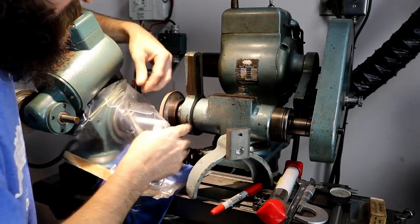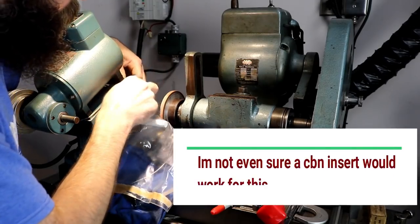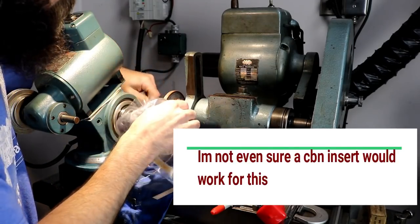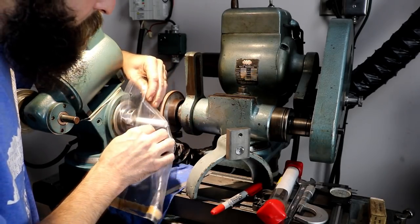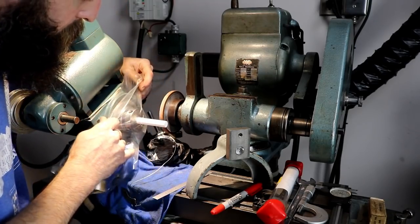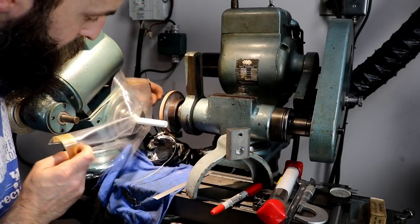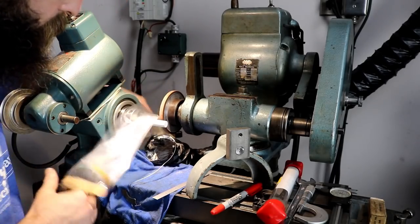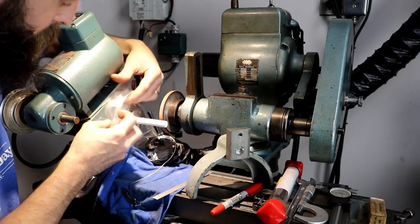And I don't have a collet system for my lathe, although I do have hard turning capabilities, or the tooling for hard turning. So I haven't tried to hard turn this, but I have diamond ground it, and it really works well. So that's what I'm going to do with this. We're just going to grind it down to size and try to put our steps in it with the best methods that we have,